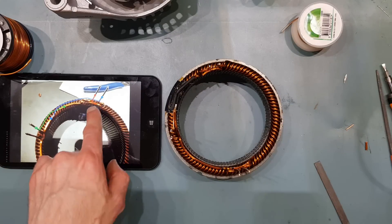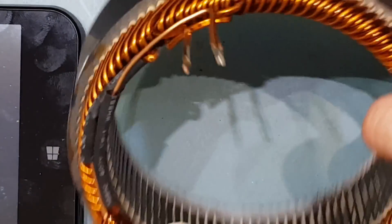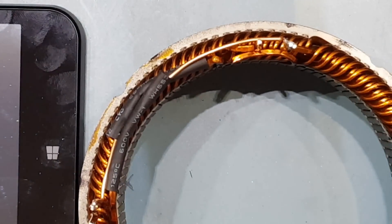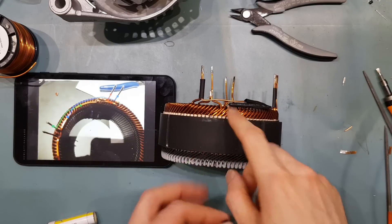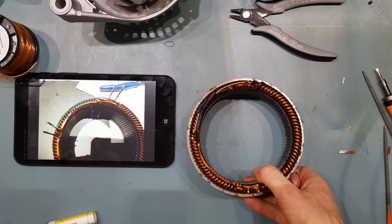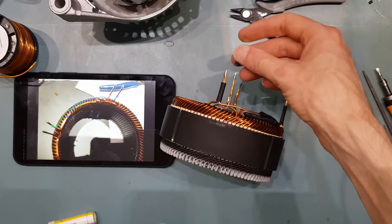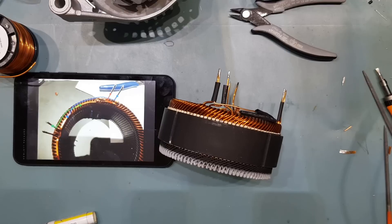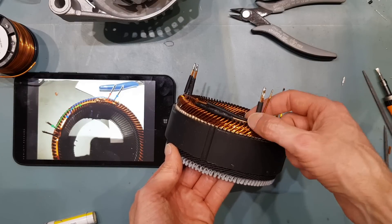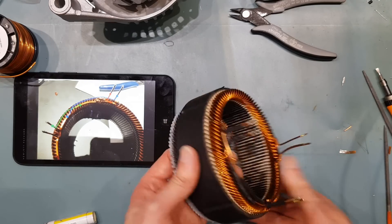You repeat it for the two other windings. So that's the second wire done — that's the blue wire I've just done. It runs from here, down here, and connects to the cut over here. The last link is done. I chose just to bend the lead up and create a butt joint, pretty much like my diagram. If it fails, it's on me and I have to fix it. I stand behind my work. I've always put heat shrink on them just so that when I come to solder these on, there's less chance of these wires moving — just by having some mechanical strain relief on there. So now I can shrink that. That side is done.